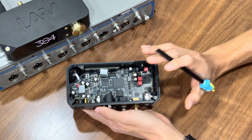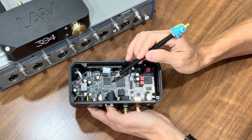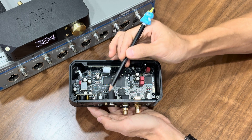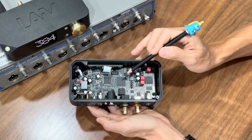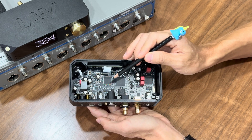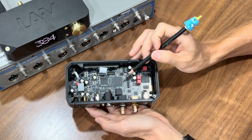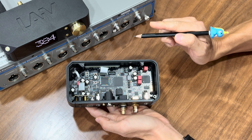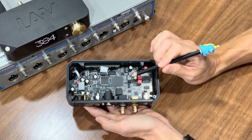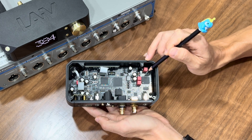Next, the digital input signal — we'll go by the USB. The USB signal is processed through a proprietary microcontroller before being converted to I²S and sent to the FPGA. The AES-EBU and coaxial are also routed to this FPGA. The I²S goes through an LVDS to LVCMOS converter before reaching the FPGA. The FPGA is the heart of the Micro DDC — a field-programmable gate array purpose-built and programmed for high-end audio. The FPGA buffers and re-clocks all digital inputs using the built-in high-precision, low-phase noise femtoclock oscillators.